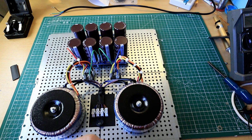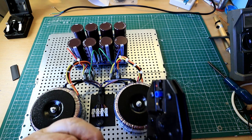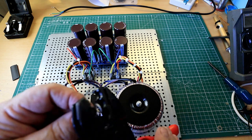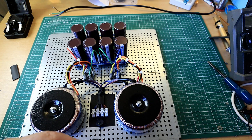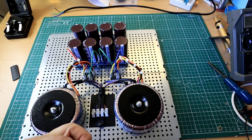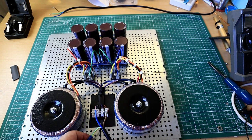This is the earth terminal — I'm just going to crimp this little blighter on here. There's our chassis earth, which will go back to the IEC cable. I'm just going to tin these — they're going straight to the chassis earth. Be back soon.